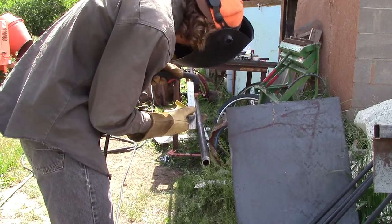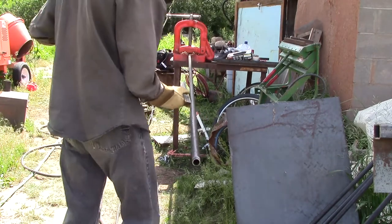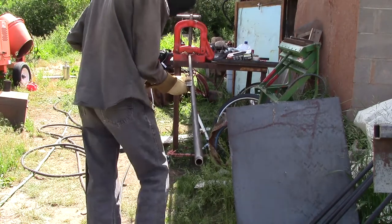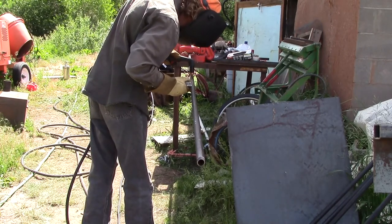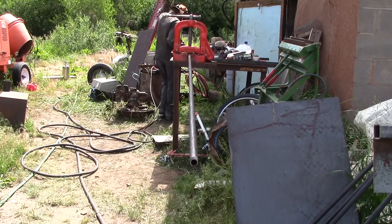So I chose to just make the total cross-sectional area of all the holes equal to the cross-sectional area of the pipe. Remember, in a closed loop, there are two pipes feeding any given hole, so the holes can be twice as big. Conveniently, this was close enough to the diameter of a hole left by my plasma cutter that I could just make the holes that way and not worry about it too much.